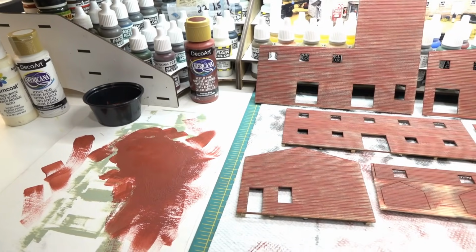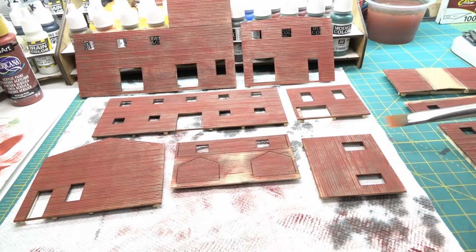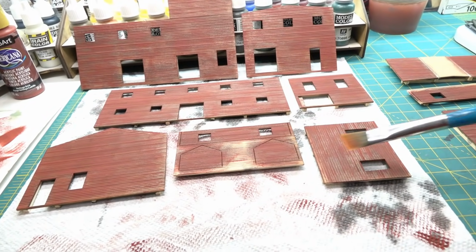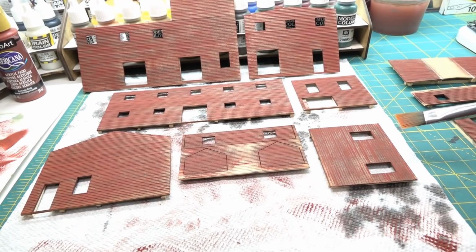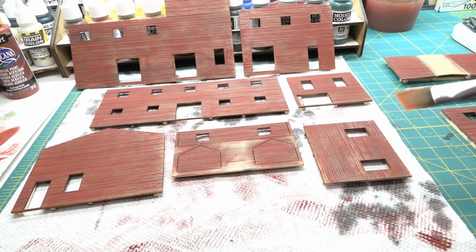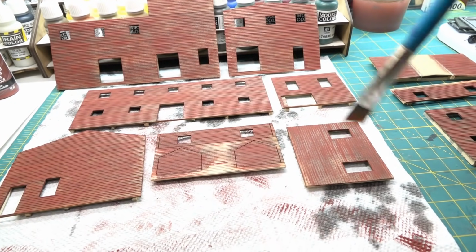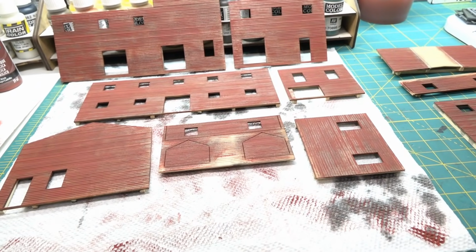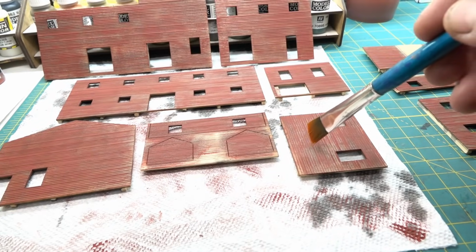So you're not painting; you're more dry brushing. I started going up the wall, up against the grain, so to speak, of the siding, and that hit the highlights. Then I would notice areas where I wanted to get some more paint. I actually went this way a little bit as well. Then they recommend using a circular motion, which really does work. Unfortunately, I can't show you, but whenever you do that, there are some areas that are heavier in paint.